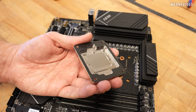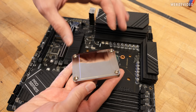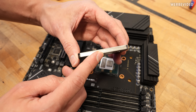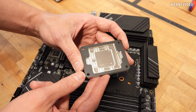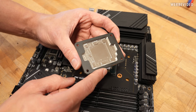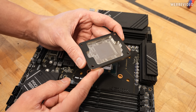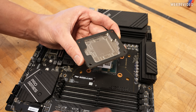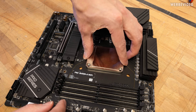That's why we came up with this design. We had our learnings from Intel contact frames — the outer shape is basically the same and also the height. It's six millimeters high, which gives it a huge amount of stability compared to the previous two-millimeter heat spreader. On the bottom we have the same shape to press the CPU into the socket. In the center there's a diamond-milled, very low roughness surface for contact, and we have an insulator sheet to prevent any electrical contact with the board.